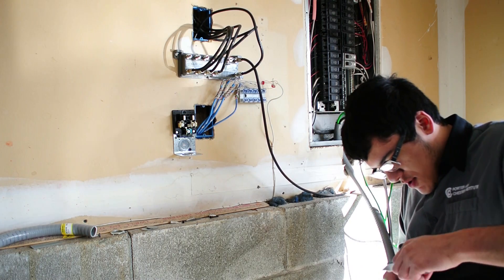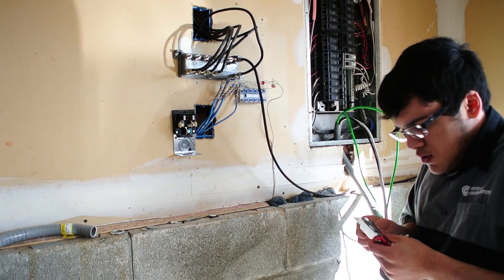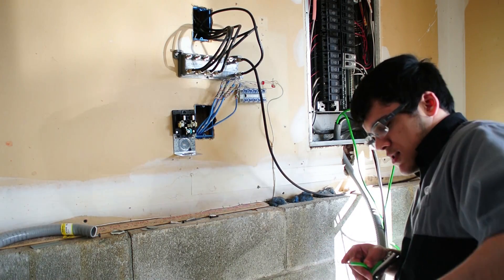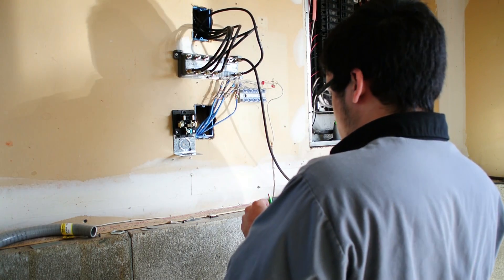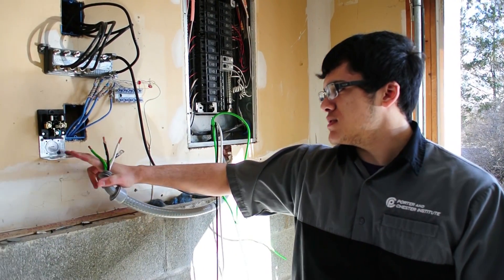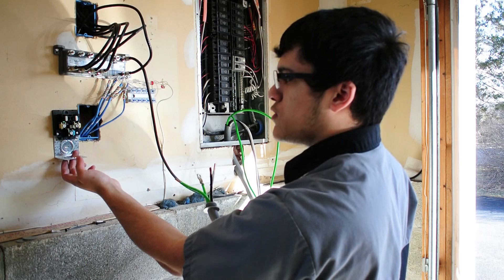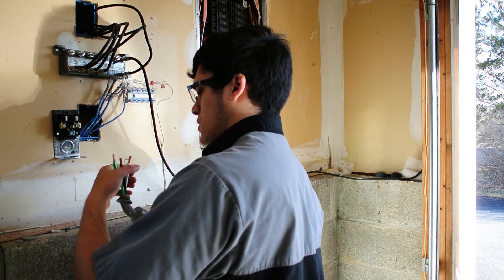This is not the proper way to cut wire either, by the way — I just don't have any means of cutting six gauge home electrical wire. Make do with what you got. On my side, the side that's actually going into the plug, I got all my wires stripped. I have this ring terminal soldered to the ground that's grounding the box out. I'm just going to run these up through the hole right here for the plug and screw this back on.